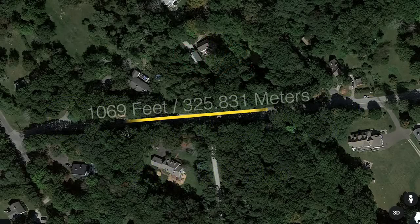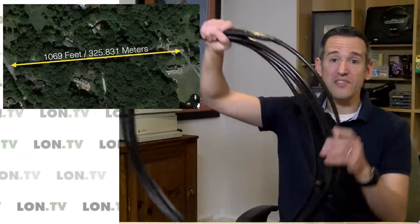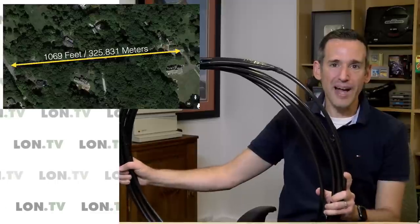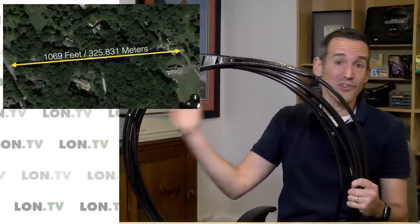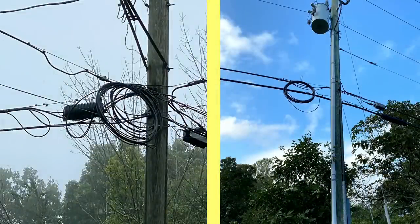Last week I showed you how they were bringing the fiber optic cable from the pole in front of my driveway to the end of the road. I have some of the extra cable here. They ran a cable with 24 fiber optic strands, but the connection I have is only going to use one or two of those. When you hear people talk about dark fiber, that's often what you've got here — strands that are available but just not in use. It costs Comcast pretty much the same to run one strand versus 24, so why not have extra capacity for later. They spooled up the cable at both ends so when the splicer came he could get everything connected.